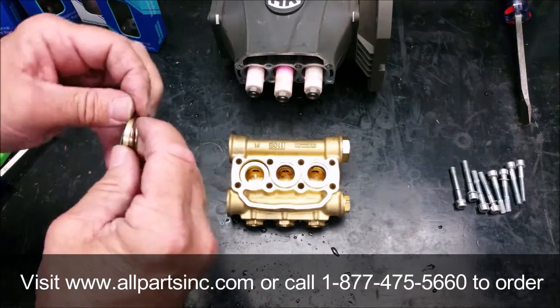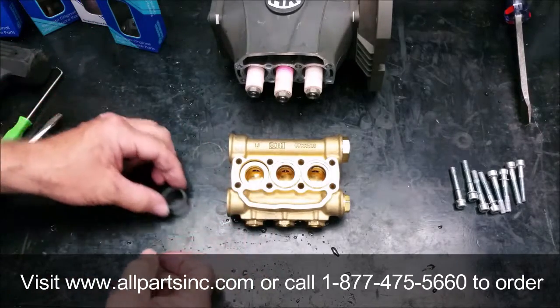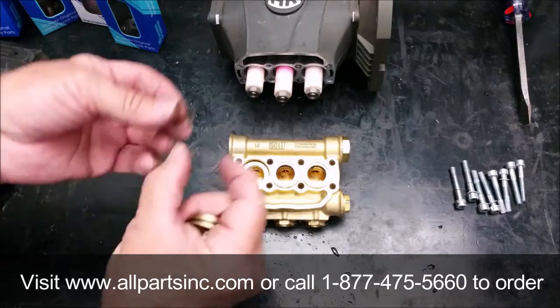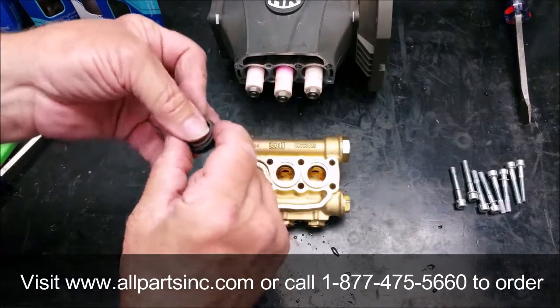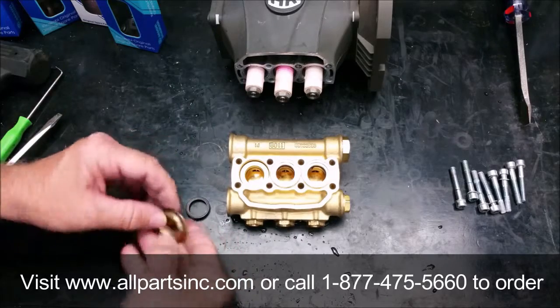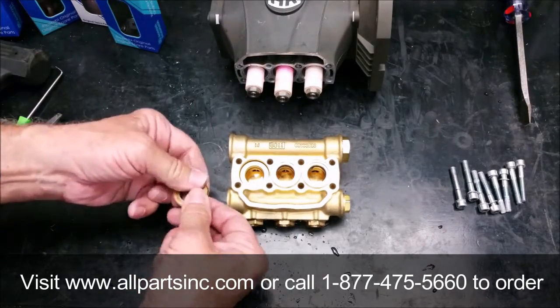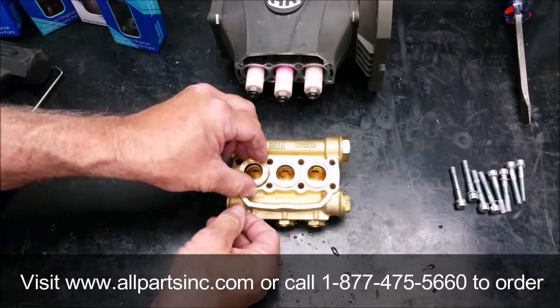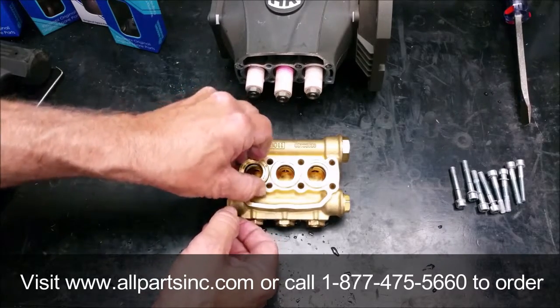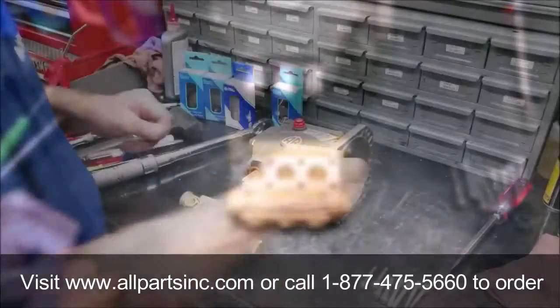Put the O-ring on the rear piston guides. Next, take the low pressure seal and fit the PTFE scraper into the top. Set the low pressure seal on a flat surface with the scraper facing up so it doesn't fall out. Press the rear piston guide on the top of it so it stays in place. Press into the manifold with the seal facing down.